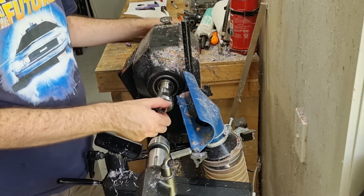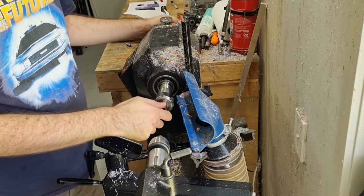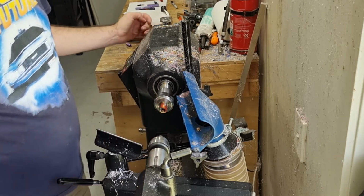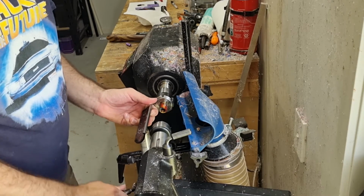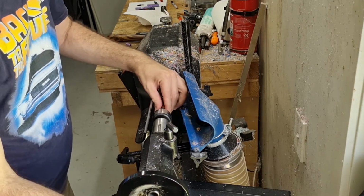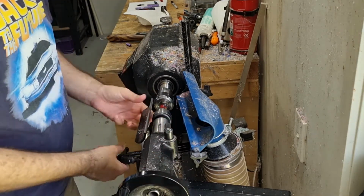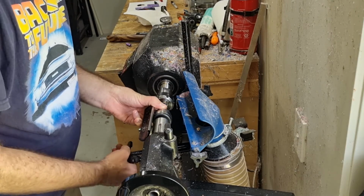So if you're going to break anything while turning, it is going to be your nib section. I've broken more of these than any of the other parts of the pen. So the longer that you can have it turning fully screwed in, the better. Okay, so make sure you get it square. So I'm going to turn with the extractor on with this just because it makes it so much easier for me.